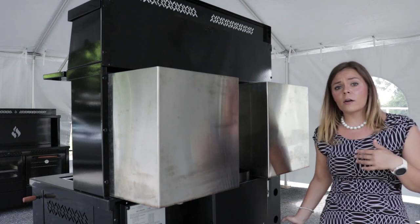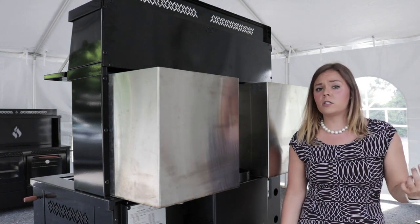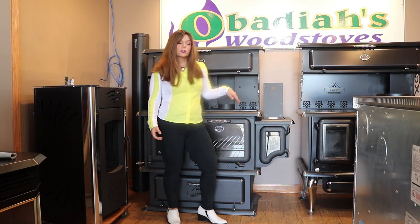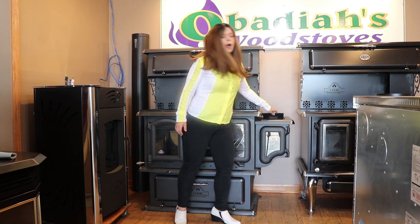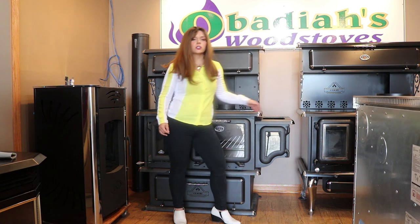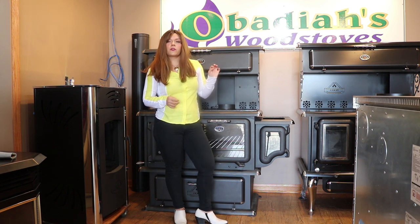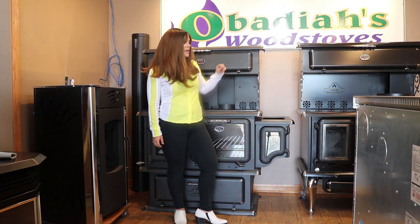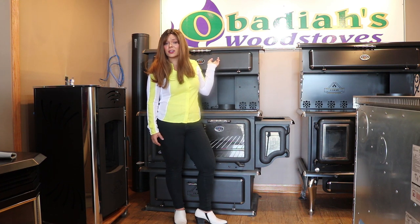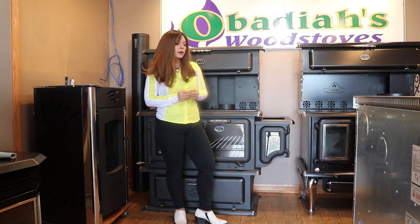It is important if you go with the water coil on the domestic hot water system that there's water circulating through the stove at all times. Keep in mind side reservoirs are going to be smaller - this one is like two gallons. Pioneer stoves have some options for side water reservoirs as well, ranging from about seven gallons on the Baker's Choice to fifteen gallons on the Pioneer Princess. Rear reservoirs are going to be usually about 22 to 24 gallons of hot water.